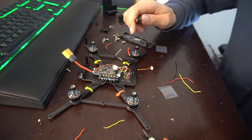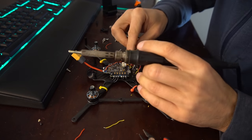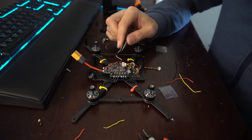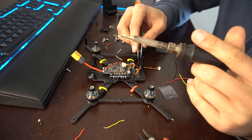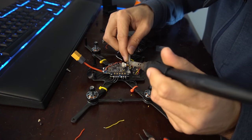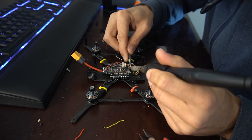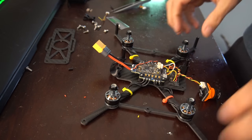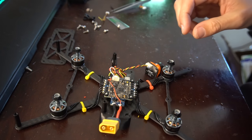Okay, so we'll start. I like to go right to left because I'm left-handed, so we'll start with the ground, our black wire. That's gonna go right next to the video coming from the VTX. All right, so next step's gonna be binding our Crossfire, so we're just gonna plug this in,